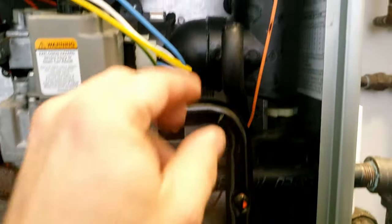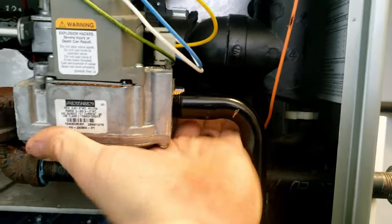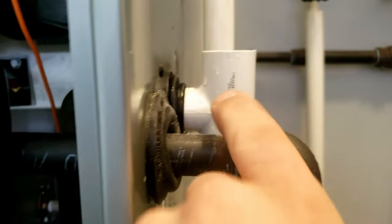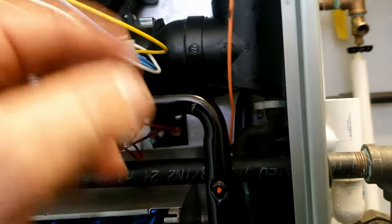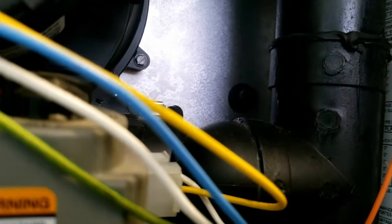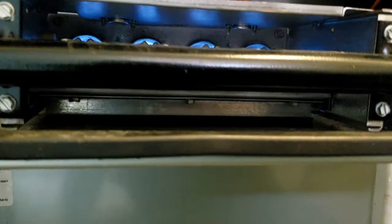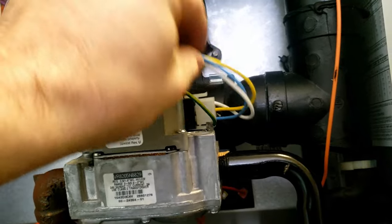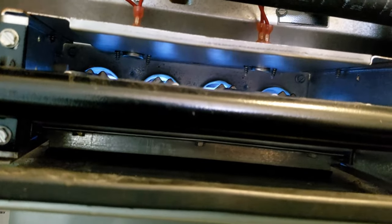For any fuzz bunnies that might have been in there. I went ahead and took the condensate line and blew through it, made sure it's clear — that's one of the other real common things, a plugged-up condensate trap. They really did not make this thing friendly, and somebody glued the trap in there, which doesn't make it serviceable at all. There's a two-stage gas valve and draft motor — you can see it starts going a little bit higher and then drops down. Looks like we've got a good flame signal.